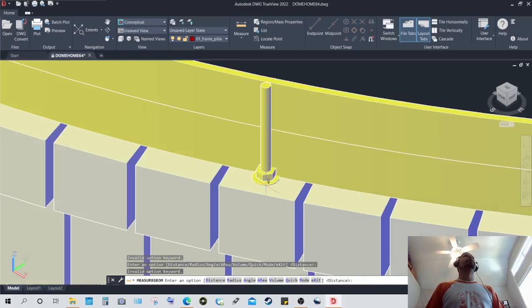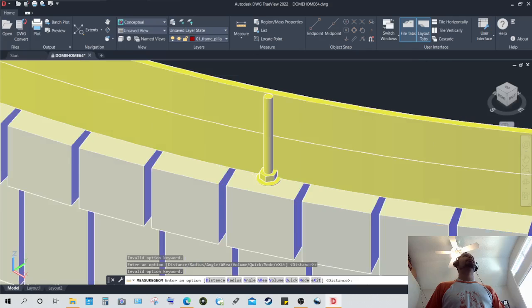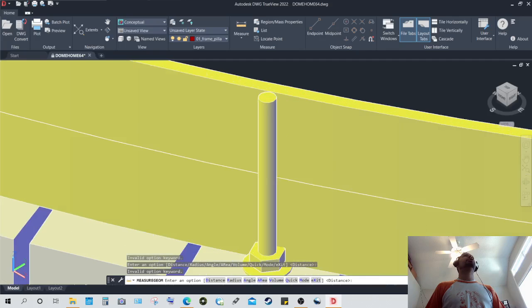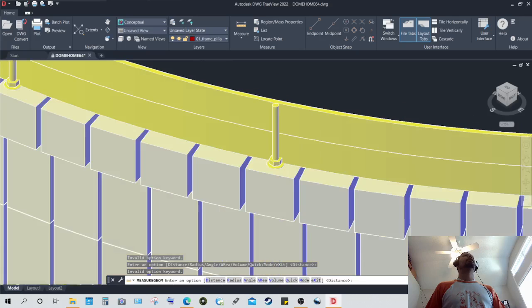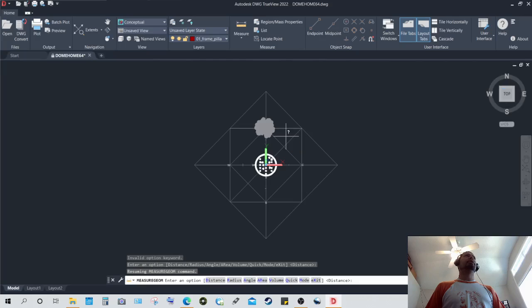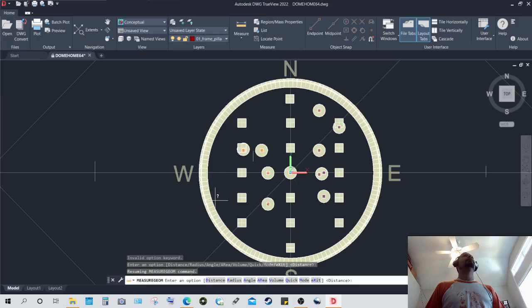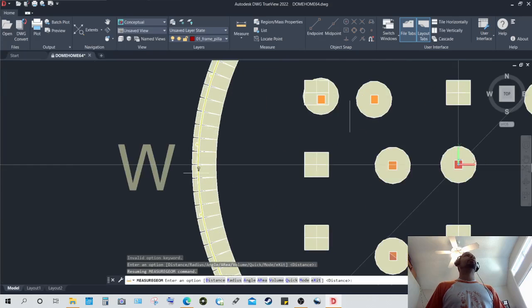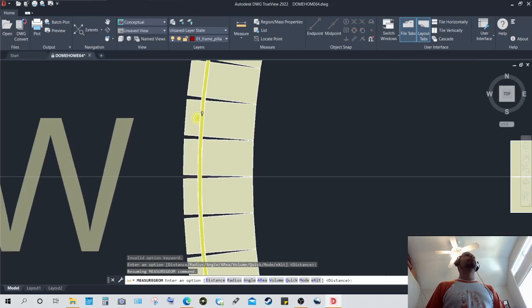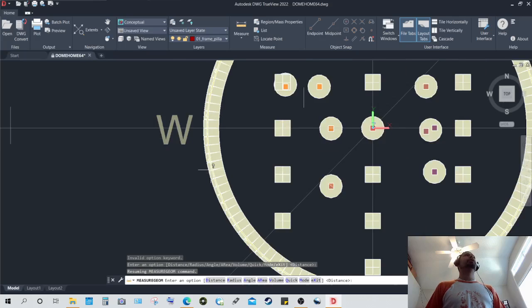And of course it's going to be secured with a nut and a washer, at least perhaps a lock washer as well. And it's designed to be about half an inch in diameter, the bolt itself, and there are 24 of these that go around the perimeter, equally spaced as much as possible. Of course, there will be some areas where you may have to deviate from the symmetric spacing because of other structures in the way or whatever the case may be. And I think there are maybe just 1 or 2 places where the spacing may have to change, as I will show you in the design.